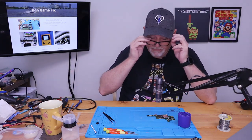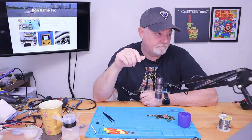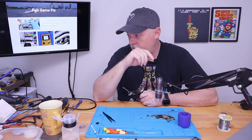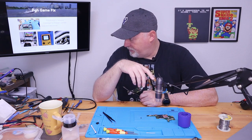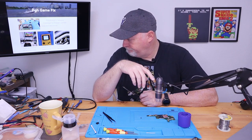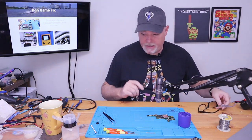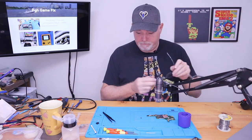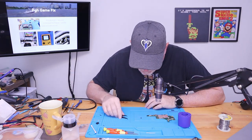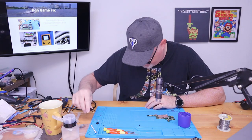There's a few ways we could go about putting the new chip on the board. We could use the hot air station to flow it in place. Some people like to touch up the tips with just the soldering iron and flow it in as they align it. But for these little guys, I almost always use the soldering station, or use the hot air station.